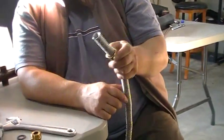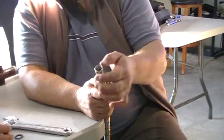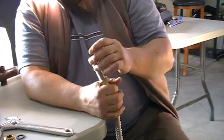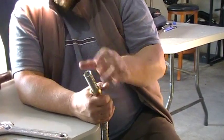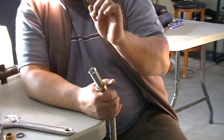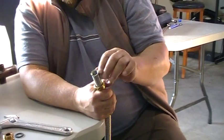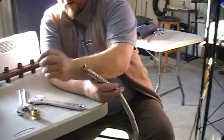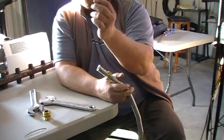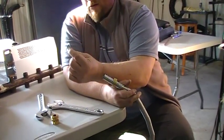If you make a mistake, come down and cut it a little bit. That C-clip there — that fell out — is essential for being able to make this fitting. If you don't have a C-clip, you cannot do it. I was doing a training in Dominican Republic once, and they ordered everything they needed and we started assembling. The bag didn't have a C-clip — we were missing one C-clip and we couldn't get this to seat right. They tried to manufacture one. Don't lose those C-clips. I always keep a little bag of them in my toolbox because they're hard to come by — you can't go to the store and get them.